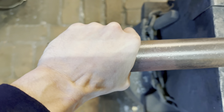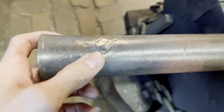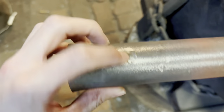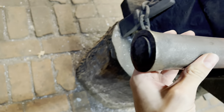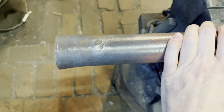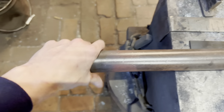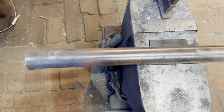After quenching, you take it over to the drill press and drill a hole all the way through the original barrel, the outer barrel, and that pin in the middle. Then 1040 steel is driven through and peened over on both sides to hold it in. So this barrel is plugged and pinned. That's how we made the other cannon barrel as well — the larger cannon is made the exact same way. Then the sleeve goes over the top of this, and another sleeve over that, then the end cap, and it's all filled with lead around the outside. So this is what's containing the pressure — one ginormous pressure container for our barrel.